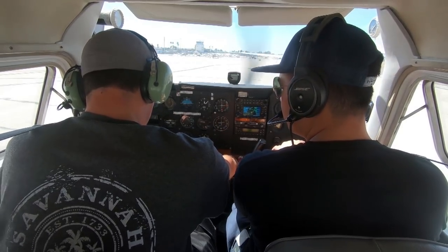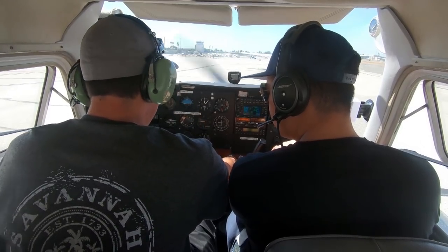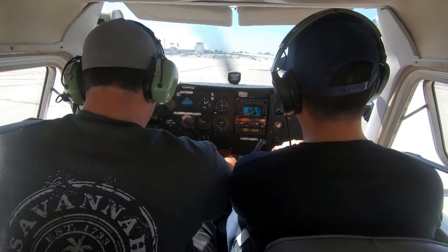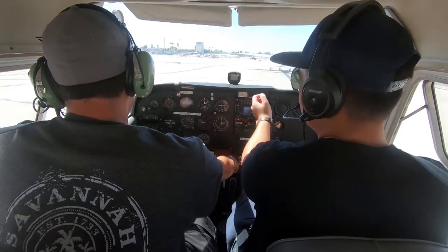Okay, and then annunciator panel, no annunciator panel. So we'll go back to 1,000. Okay, don't forget the suction gauge, right? Go add some power back to 1,800. I don't even know how I jumped right over that. Yep. Suction gauge. Showing suction. Okay.